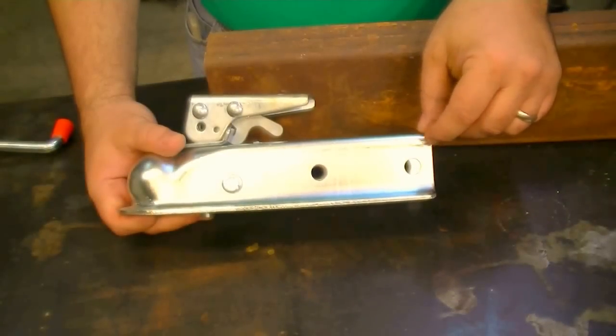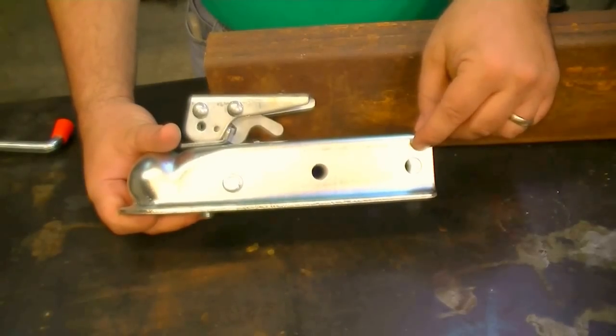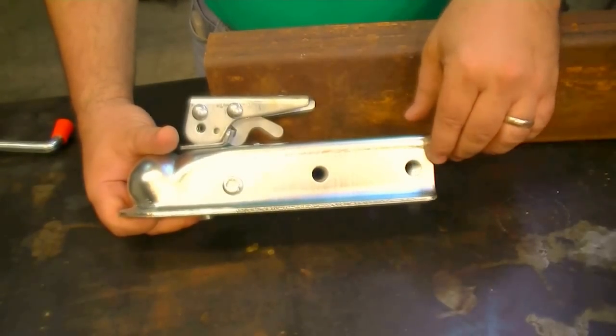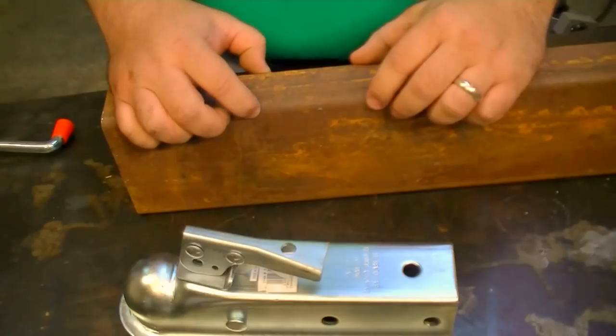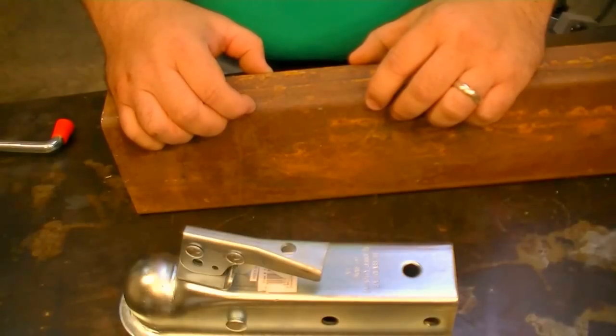If you're just beginning to weld, don't try to take on a repair like this or even try to build your own trailer. This takes a good bit of experience and training. I've been trained and I'm showing you this as an example of a plug weld, but if you're doing this yourself, you need to understand you're taking on legal liability and responsibility if this weld were to fail going down the road. This is a piece of 2x5 11 gauge material replacing a hitch that was 2x3 by 16 gauge — 16 gauge was just a little bit too light for that. You can see in the picture where the tubing broke in half going across a railroad track with a load on it. Please be careful when you do this.